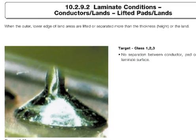In reality, we can't really answer the question as such. It's not a plated through hole — it's a surface mount land. It hasn't been exposed to a thermal stress or rework simulation, which is the requirement in the printed board spec. So we really can't compare apples to apples in this case where the solder paste on the surface mount land can't be absolutely defined as a rework simulation or solder float.